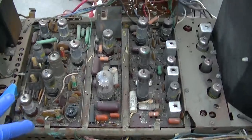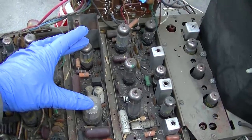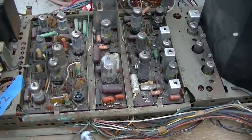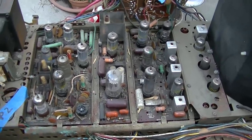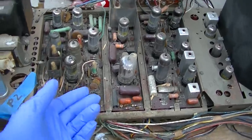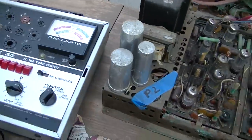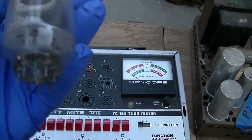Everything checks out here, except these two were the ones that initially had grid leakage that kind of mysteriously went away. I don't know. It's very damp out here right now, and it rained a whole lot the other day. And yes, the TV was covered up under multiple layers, but if there's just a microscopic film of condensation on this thing, this will pick it up as grid leakage. So it doesn't... Yeah, I think this is history.